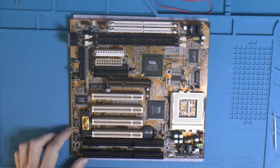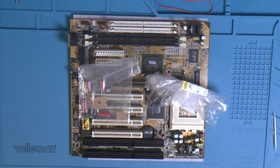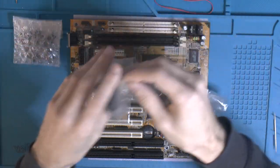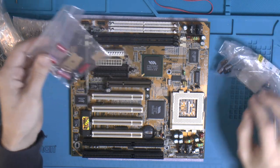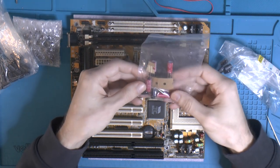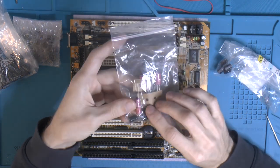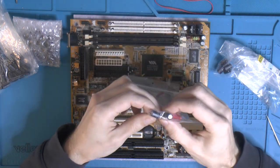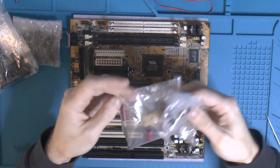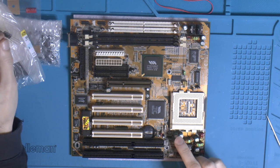So I've sourced some caps. I have a few different types here. I took what I had left. The small ones aren't really an issue. For the big ones, all of these big ones are 1000 microfarads, 6.3 volts. So I got a couple of 1500, 10 volts, 2000, 10 volts, a couple of 1000 Philips here, 10 volts low ESR, plus I got another 4 here. So that should cover everything we need, so we can have the Philips on the V-core side,